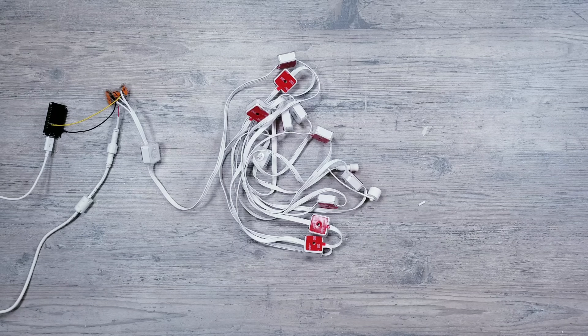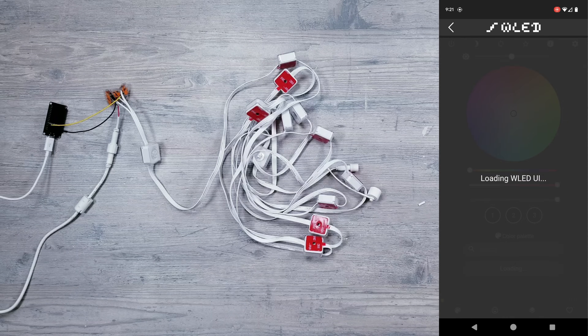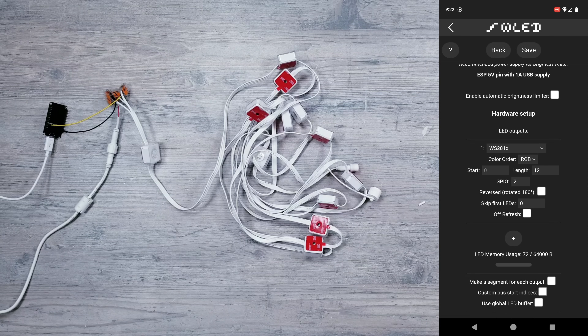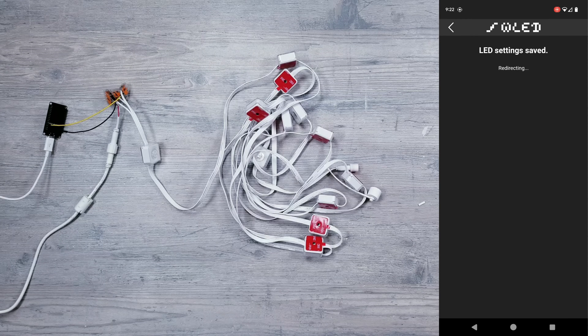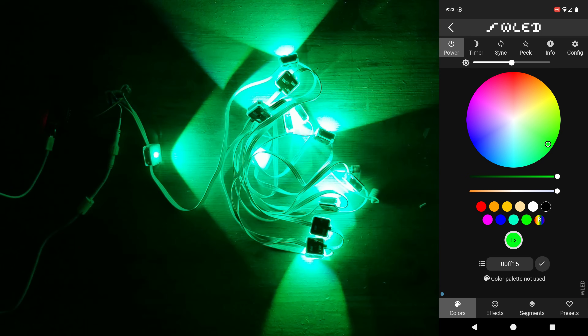The moment of truth has finally arrived. Once everything's plugged in, go ahead and pull up the WLED app. I do have a lot of controllers around the house running WLED, but the one connected to these lights is right here. Once you're on the main screen, click Configure near the top right, and then into LED Preferences. Scroll down, make sure you have WS281X selected from the drop-down, make sure you indicate what your data output is — since we connected ours to the D2 pin, I'll have two in this field. For your length, you can manually enter how many lights are connected, which currently there are 12 in this setup. Then hit Save near the top and your lights should automatically come on. Just like that, these lights are connected and 100% being controlled with WLED, and all the animations and effects are working absolutely flawlessly.